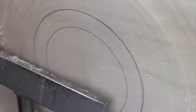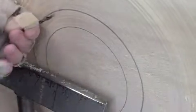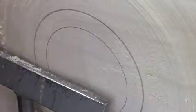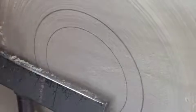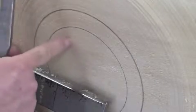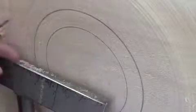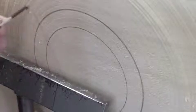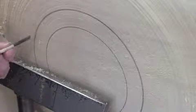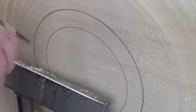So the screws go in this distance. I didn't take the tape off so that I can measure that on the outside edge of the piece, and then measure backwards. If I measure in this direction, it's going to tell me how deep I can go here without hitting the screws on the other side. And that's real important to know, that distance. So it's the best way I can describe it. It's a real simple gauge.